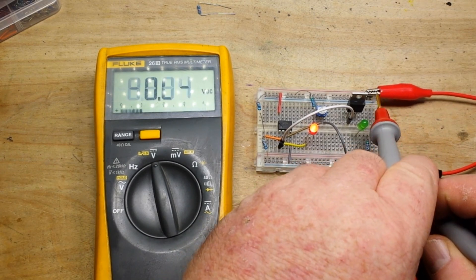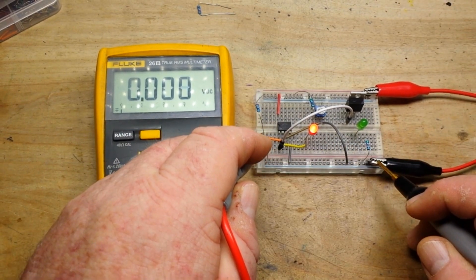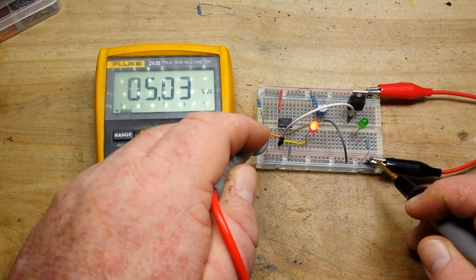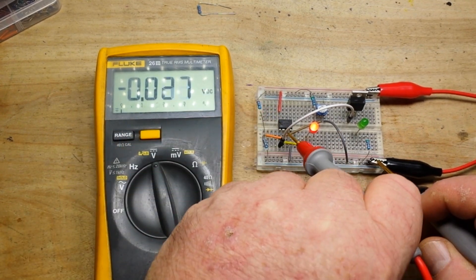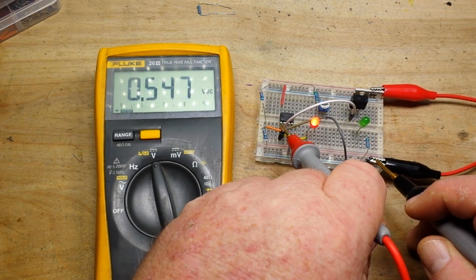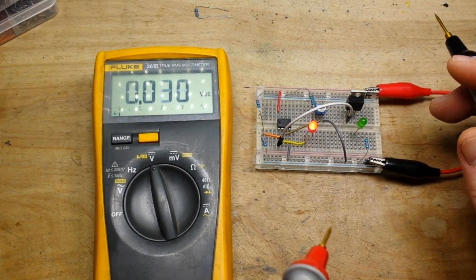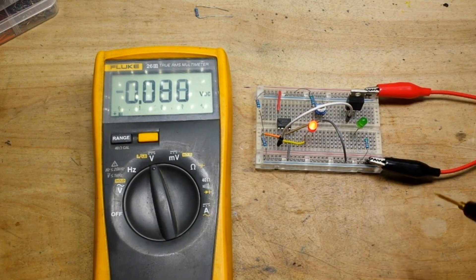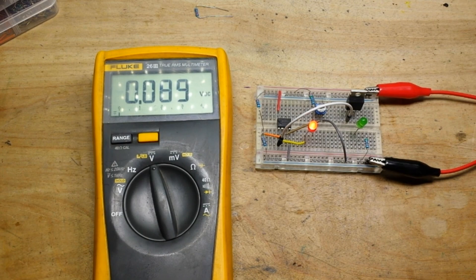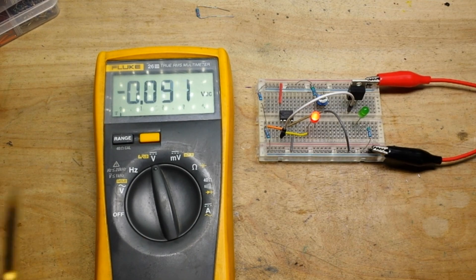You can see our circuit voltage is still 10.06 volts; our cutoff voltage is now 5.03, which is below the 5.04. Now with respect to ground we're showing 5 volts there, but we're sinking current. So if we take that with respect to VCC — yeah, that voltage is still going to be positive flowing into there. I had to think on that for a second.